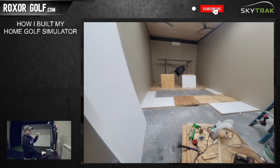I set a pole from the enclosure down and figured out how tall the floor needed to be to cover the pole - with the turf and padding underneath, I needed to raise it about an inch and a half to inch and three quarters. For a cheap way to bring the floor up, I used half-inch foam board at about $6.90 a sheet, sandwiched with another piece of plywood on top and screwed through it all. It actually works well because it gives a little cushion underfoot - better than just hard concrete.